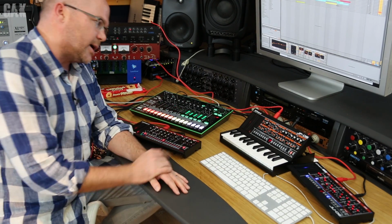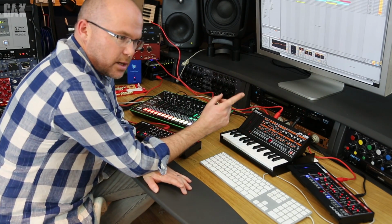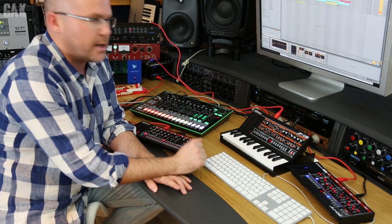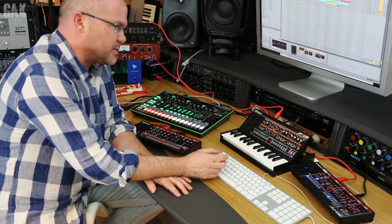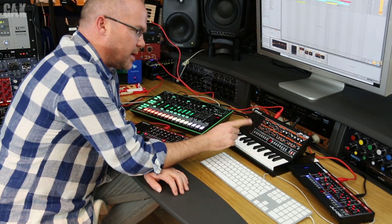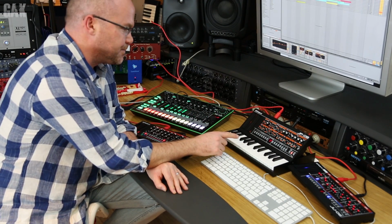A couple of things we have found out. I wanted to go and get some micro USB cables and tried to plug it into this computer, but the driver will not load on anything lower than 10.9 for a Mac, and I think Windows 8 for Windows. So do check the driver specifications, because there are some nice bits like sending MIDI via USB. And if you're after a micro USB lead, the Samsung phones are exactly the same type as the USB here.